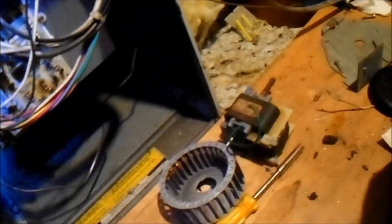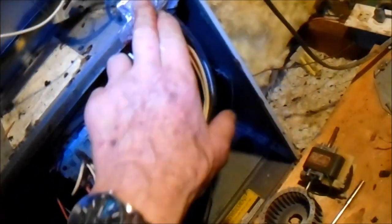That's your tip for today. Now if you're working on your heater and you don't see that red light right there, that means you don't have power to the unit. This is also the cutoff switch — this one's bypassed so we can check it. If the door's not shut and you don't have a bypass, the heater will not come on.